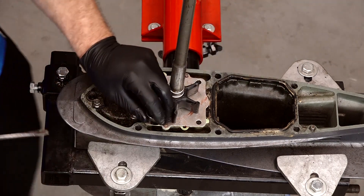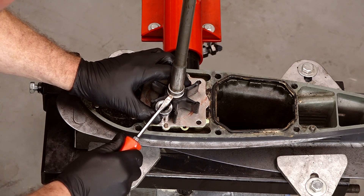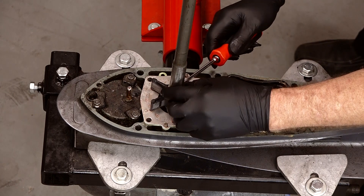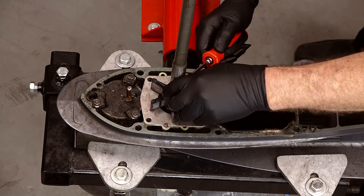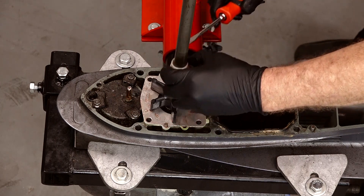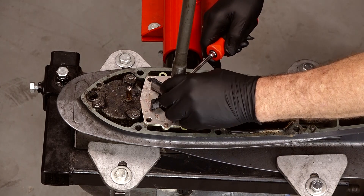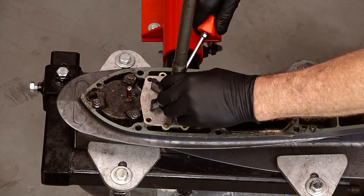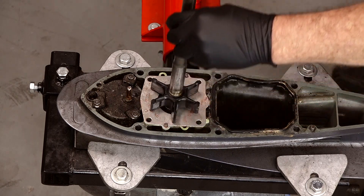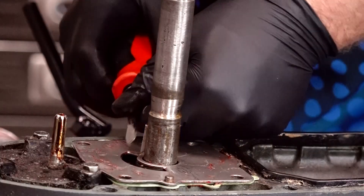It takes a little bit of patience. Make sure you don't get under the nylon, otherwise you'll snap it. Now you can see where the spacer is actually split, so you can just open it up a tick and then slide it up. Next you have a flat washer, and then what they call a wave washer, and then another flat washer down at the bottom — three of those all together. Next we can go ahead and pull up the impeller itself and remove the key.